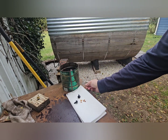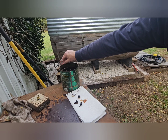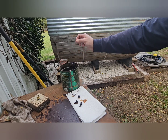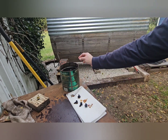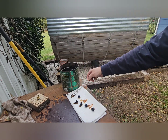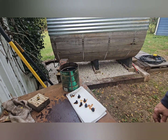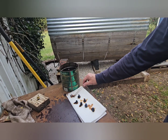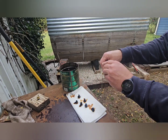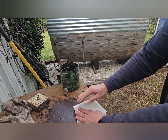After the last round I just dumped them out on a paper towel — the bolts aren't hot anymore at that point. As for the container, use something metal; you wouldn't want to use plastic. Also use something fairly large, not like a coffee cup, because the bolts need enough oil to cool off properly.